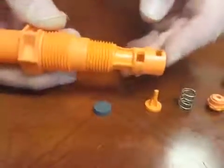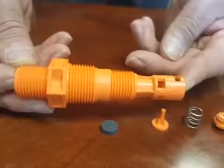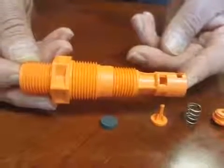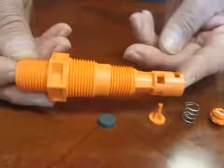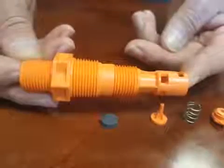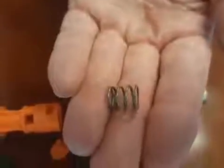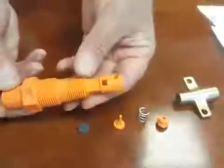This mister is made entirely out of glass filled PVDF which is resistant to all agricultural chemicals, and includes resistance to 97% sulfuric acid and 12% chlorine solution. The spring is made out of Hastelloy C which also is resistant to all agricultural chemicals including sulfuric acid and chlorine solution. That's the basic components.